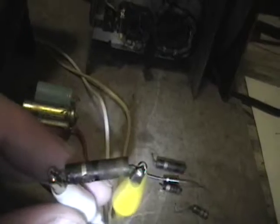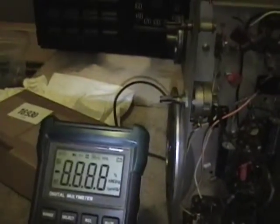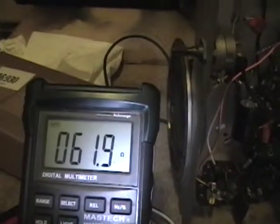These resistors are made of carbon composition, which tends to go up in value with age due to the nature of the material. For example, here's one that was supposed to be a 33 ohm resistor — when I measured it I got 61.7 ohms, or almost double the stated value. I got similar readings for these other resistors, so that's why I replaced all of them. I've already talked about how capacitors go bad with age as well.